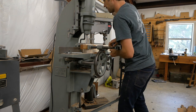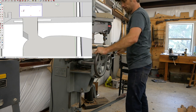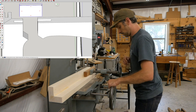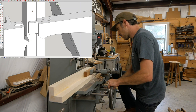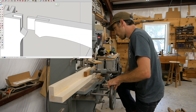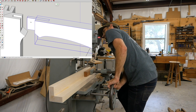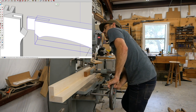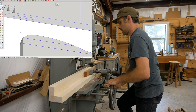While I'm setting up the mortiser, let me explain this joint. It's kind of a hybrid of a mortise and tenon — I call it a slip joint. Basically, I have a floating tenon that will fit into the apron slot we're going to cut on the mortiser. We'll glue that in place and cut the exact same matching slot on the leg, then glue the table together. That spline — that additional piece — attaches the two pieces together and creates a pretty strong joint.